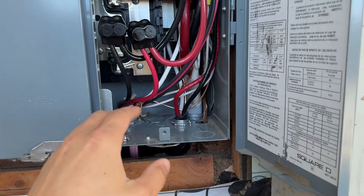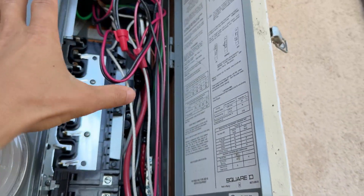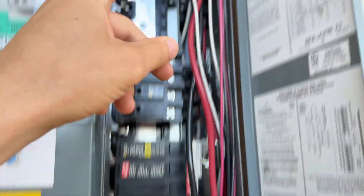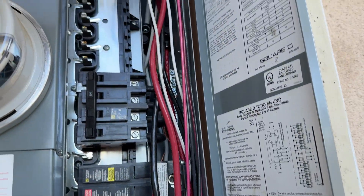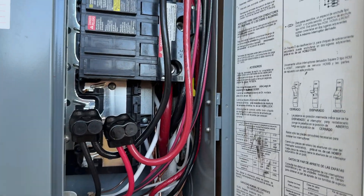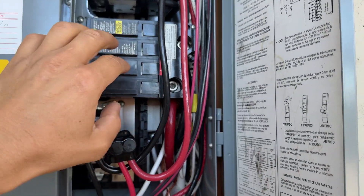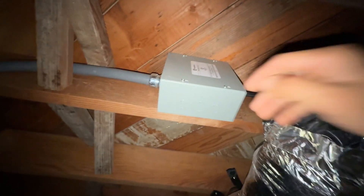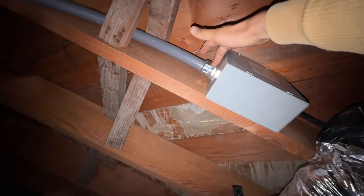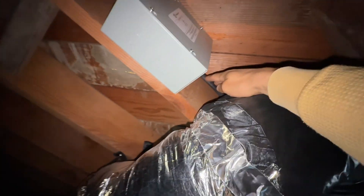Here's the panel inside. Whatever wires were coming from the bottom we just moved them and did splices in the crawl space. Whatever wires were coming from the top we used insulated tap connectors and wire nuts. One tip: if you're installing a lag kit, install it on the top or on the opposite side from where the cable is coming, because two-aught cable is hard to bend and positioning it that way gives you more room to navigate and makes it easier to bend. In the crawl space, when we needed to splice thick cables, we installed junction boxes — on one side attaching the original cable and on the other running 6-3 ROMEX, which is rated for 60 amps, going to the subpanel.